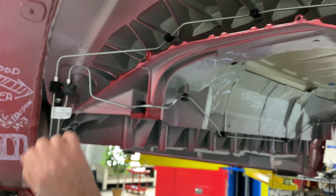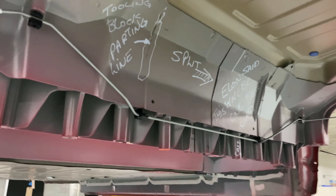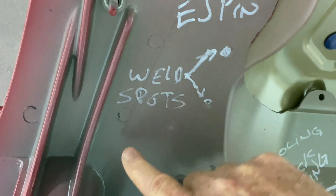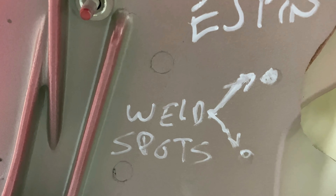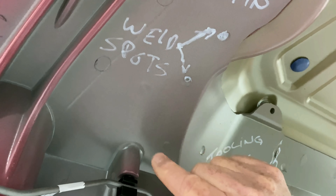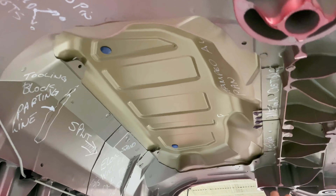So we've got the aluminum extrusions and we've seen these recesses fully utilized. Under here you'll see little bumps or depressions — those are ejector pin locations. When the part is cast, these pins push the casting out of the mold. You'll also see other spots that look like depressions — those are weld spots where they're welding the mega casting to the stamped aluminum pan.